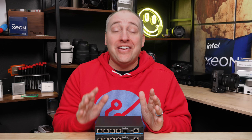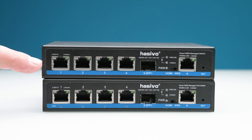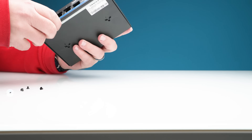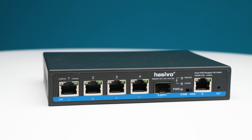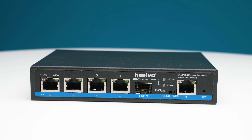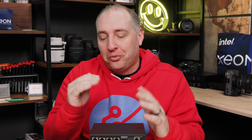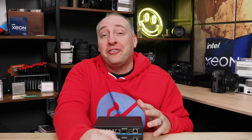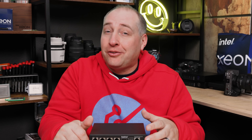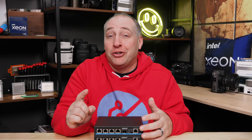With all of these videos, I love to have a key lessons learned section. First, these switches are pretty cool if this is the exact port configuration you need. If you need PoE, get the PoE one. If you need a different port configuration, get something completely different. One thing we found during testing that I did not love — and this was actually first found by someone on the AliExpress review — is that all of these are manufactured with the same MAC address from the factory. So if you try putting two on the same layer-two network, you're going to have issues with two devices sharing the same MAC address. Hopefully they've fixed that, but if you only have one, you probably don't care. If you have a bunch of them, though, that's going to matter sooner rather than later.